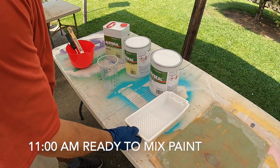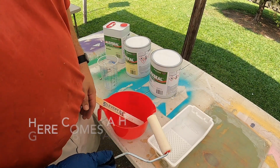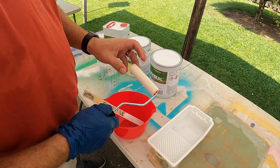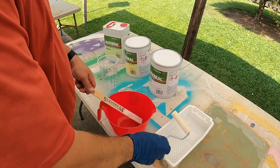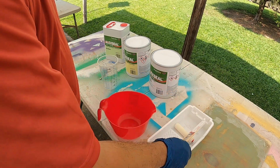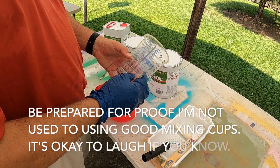All right, so we're fixing to put the first layer on. Trying to get everything laid out here. I've got a mini coater, I think it's a mohair roller. I've already taken some blue masking tape and rolled the heck out of it, up and down, to get any fuzz off of that. I wiped all this off with denatured alcohol. Same thing here, as I sanded this down, I wiped it down with alcohol, because I'm going to have to reuse that one. So my plan is to start with just kind of a shot in the dark.